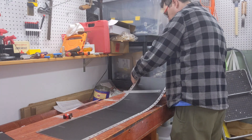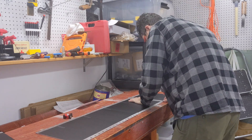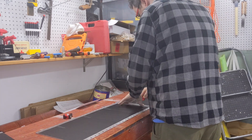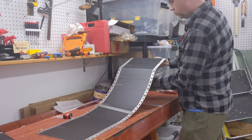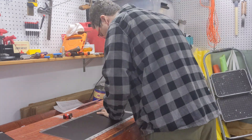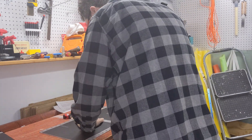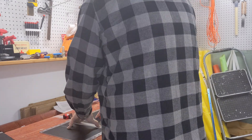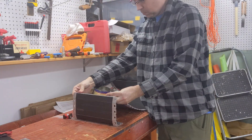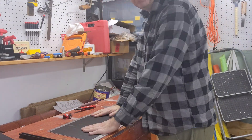I'm not joining the belt into a continuous loop yet — I'll do that on the doppelbot, which is my ancient CoreXY test rig. It's only six or seven years old, not my oldest by a long shot, but by far the most convenient platform for attaching a belt. I've previously used a smooth belt on this machine — you can check the other videos — so we're using the same drive, just a couple of stepper motors belt driving the rear roller. We'll replace the rollers with some conveyor belt drive-ended ones, and it does have a heated bed, so it should be just a drop-in upgrade. I do need to make the top and bottom of the belt flat, which is why we're doing this maybe a little oddly — designing and assembling hinges would be a lot more tedious, so we'll wait to see if the concept works before we go that far.